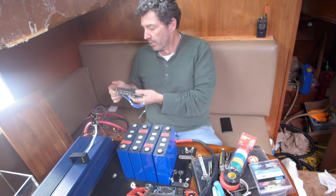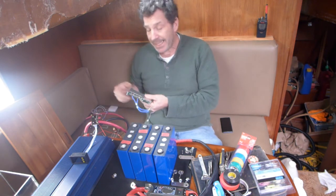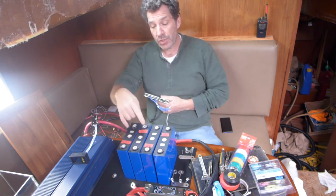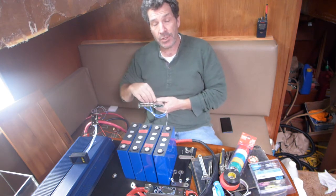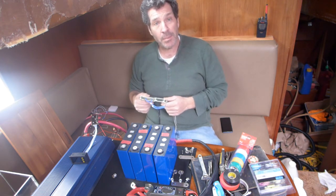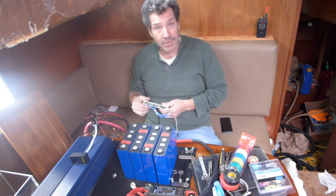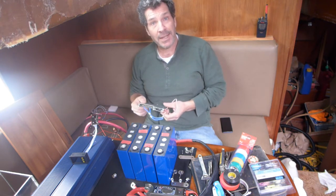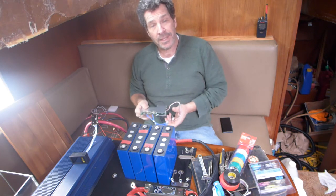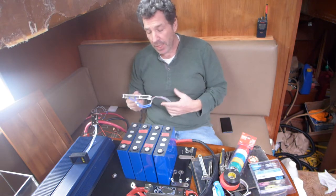It is 4S. S means the number of cells — 1, 2, 3, 4 right here — so this is a 4-cell BMS. It definitely matters that the number of cells you hook up has to be the right one. So if you're doing 12, 24, or whatever voltage, the number of cells you're hooking up to make your 12, 24, 36 — you can even do 18-volt batteries. It definitely matters, so you want to make sure you order everything in conjunction to make the number of cells appropriate for your BMS.